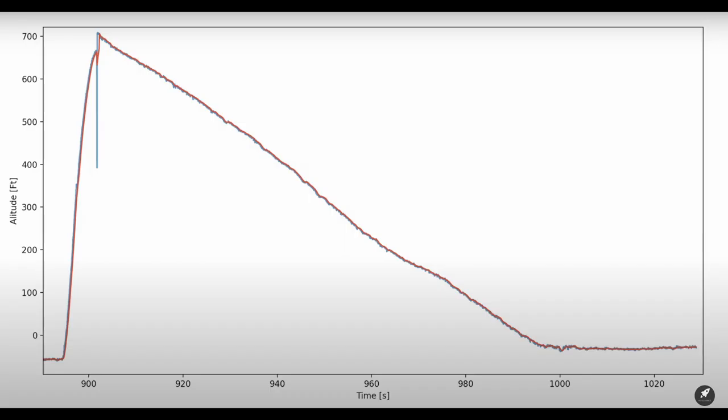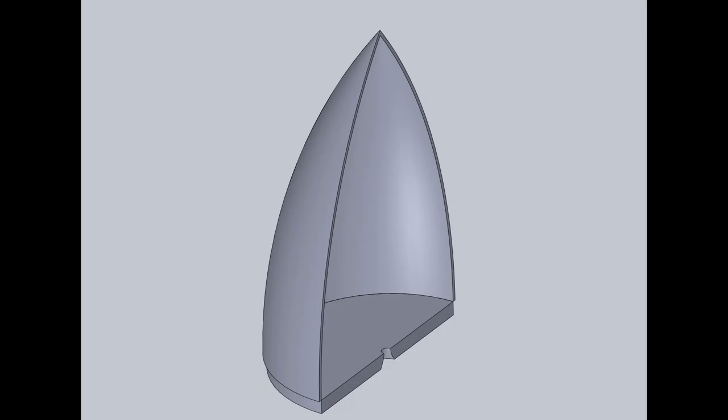Having the altimeter on board is also important. When it sees the altitude stop increasing, it'll know it's hit apogee, or the highest point in flight. At this point, the computer will eject the parachute. The chute will be housed inside this 3D printed nosecone. It'll be 3D printed as two separate parts, and will act kind of like a payload fairing. It'll open up to let the parachute out. To open the nosecone, we'll use this solenoid. It'll push the nosecone upwards, and cause the two pieces to split once they're no longer held together by the body tube. It'll get held in by this 3D printed housing. The housing will get screwed into the rocket, and it'll have two eye bolts at the top, to tie the nosecone pieces and the parachute to.